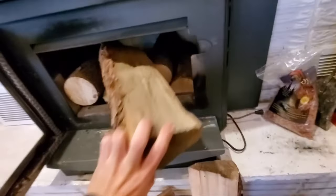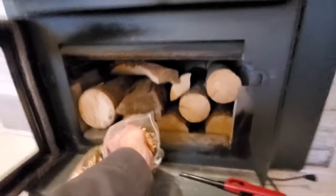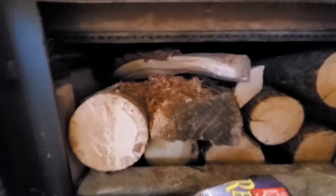A little bit longer log is going to stick out just a little there. I'm going to put a split log on top because I need something to ignite — I need to be careful that the ceiling baffle is close. Now I'm just going to take a handful of this easy-to-light product — it's a wax-impregnated sawdust. We're going to sprinkle it and push it back into the pocket. We've got our easily ignited combustible material back in there. You can use some paper to help accelerate the burn, and then we're going to just touch it off.